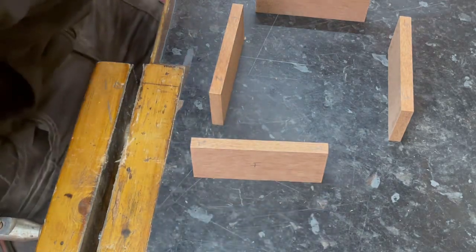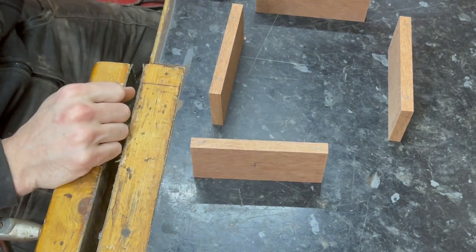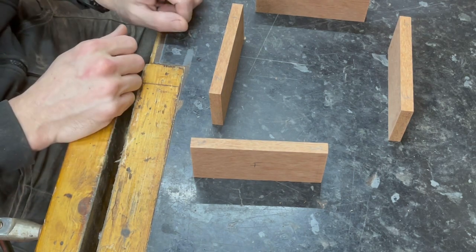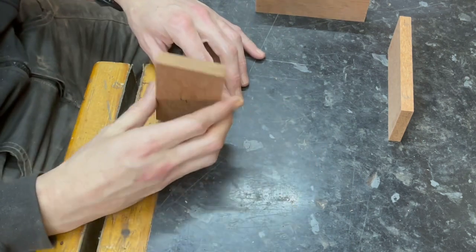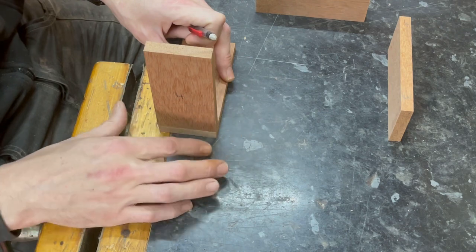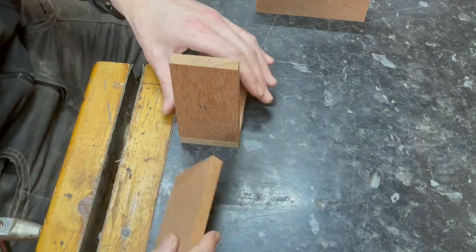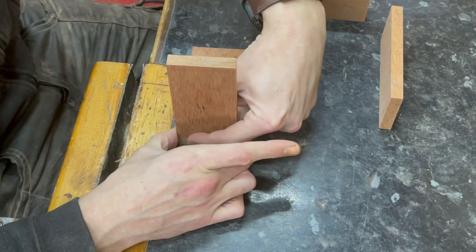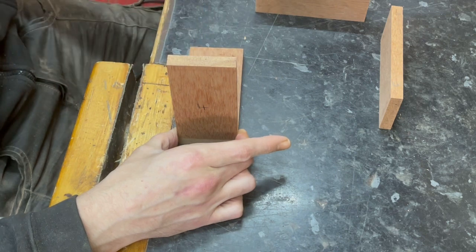So, to cut the dovetails, there's a few ways you can measure them up, but there's wee dovetail guides and all that. I always like to do it by eye, so that they're always unique. All the boxes you make, they look different, you know what I mean? So obviously you want to find the depth that you're going to be going into the wood. And you can do that by just lining the wood up and scribing down the back. I always like to make the marks on the inside. And you can use a wee knife, pencil. You could use the other bit just to make sure it's completely against the edge, which is a good idea. Or you can use a marking gauge. It's a good idea. I've got all that stuff there, but it's good discipline. Good discipline to do that.